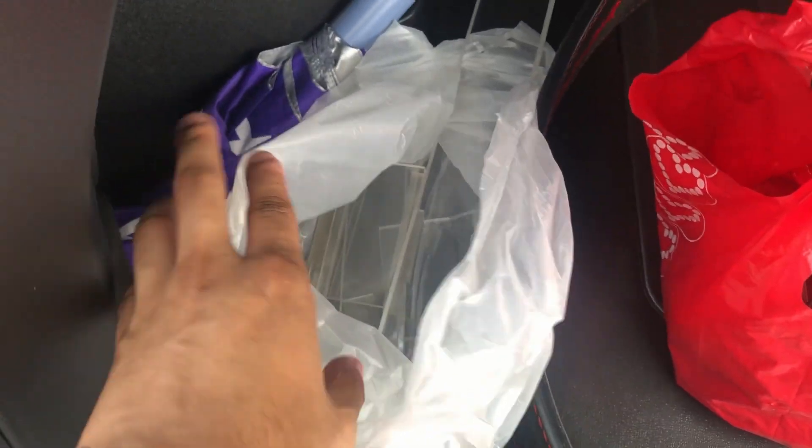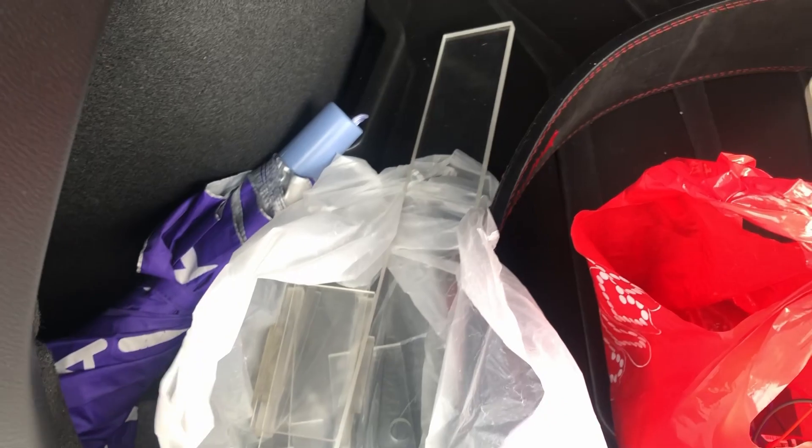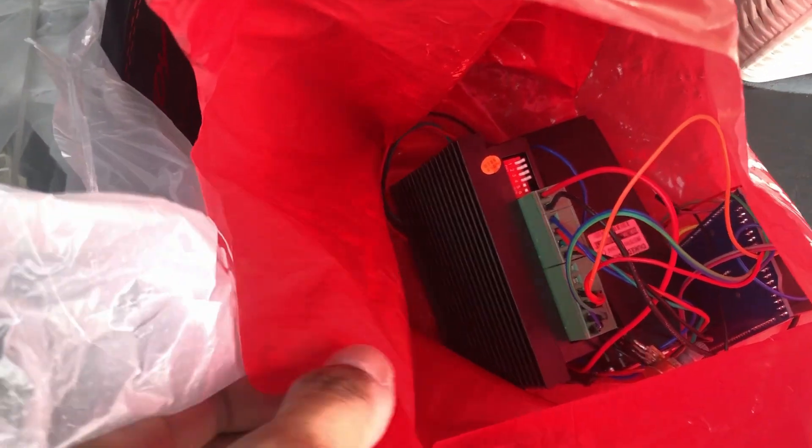There's got to be a lot of reduction in the transmission and the motor is going to be kind of heavy, so we have to optimize all of that to make sure it's comfortable for the user with great ergonomics and safety. Here are all the parts for the frame — we're going to be using acrylic. Our professor suggested it. And here's our motor, which outputs about 3 Newton-meters of torque, along with the Arduino controller and the motor driver.